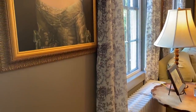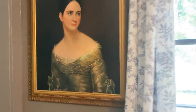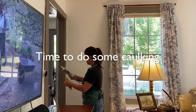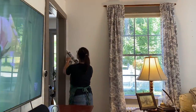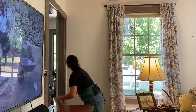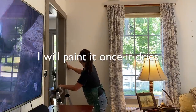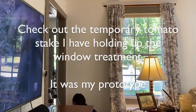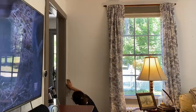Have any of you painted something that you thought you would really love and then stood back and said, no, I don't love it? Well, we decided we didn't like the white trim. So what I'm doing here is I painted the trim all in Iron Gate from Benjamin Moore and I painted the walls Simply White. I am caulking in the seam of the wall where it was an inch smaller at the top than the bottom — I hand cut some wood and I just have to fill it so I can paint it and it won't be seen. There'll be trim all around that, but I want it to look nice until I get that second layer up.